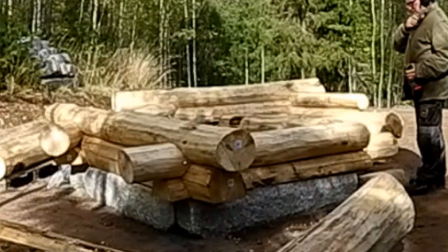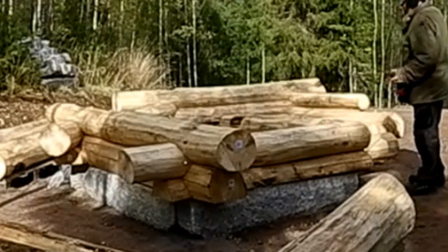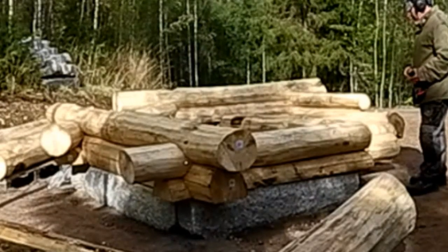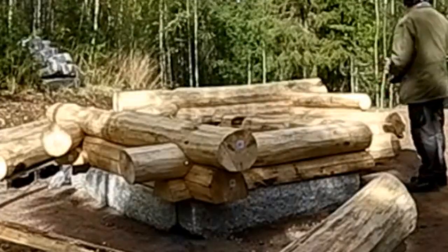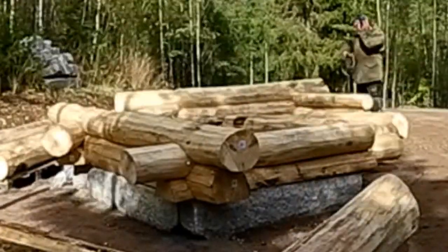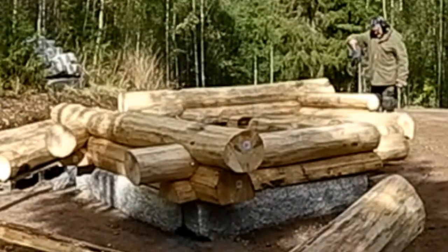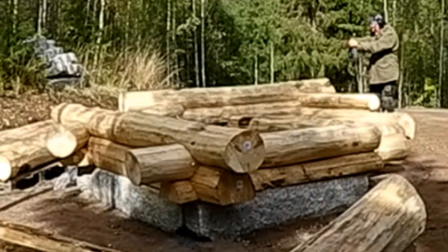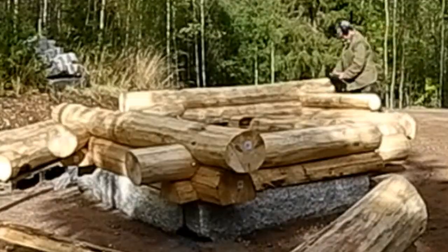So that went really tough through the wood. I mean, it is a stone drill bit, but usually it goes through okay. But this was quite tough. But it went reasonably well into the stone, which I'm surprised at. Don't want to overheat that drill bit going through the wood. I'll give it a break.